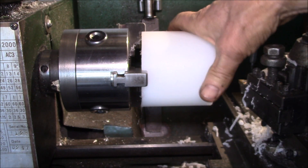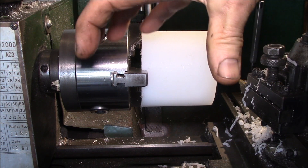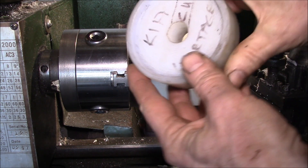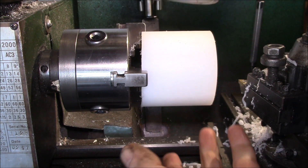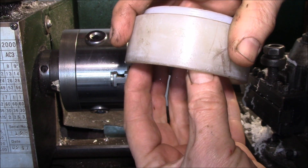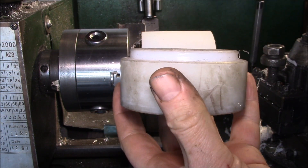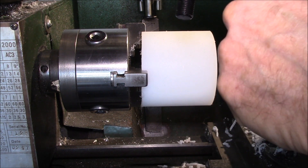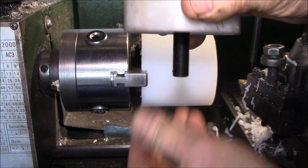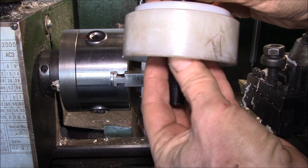The Kia Sportage is rather unique. The way it works is the rubber bushing sits on the frame bracket, there's a steel cup welded to the bottom side of the body — that's what this represents. This steel cup sits on the bottom side of the body, that rubber bushing goes inside of here, and the idea is this cup keeps the rubber from expanding out as it's compressed. There's also a stud welded into the body that comes down, and a nut is placed on the bottom — that's what holds the body down to the body mount bushing and the bracket on the frame.